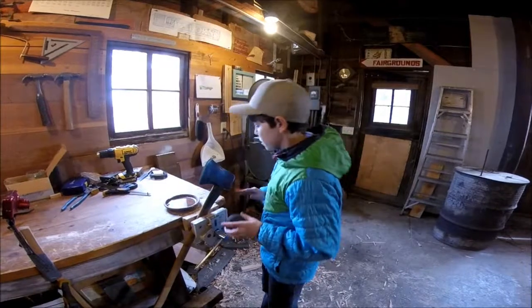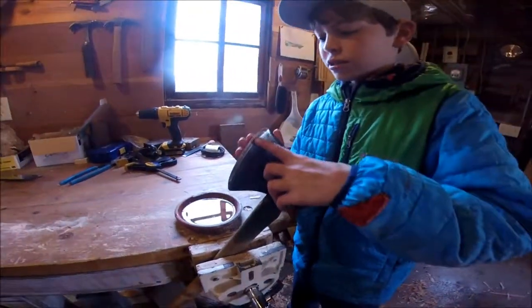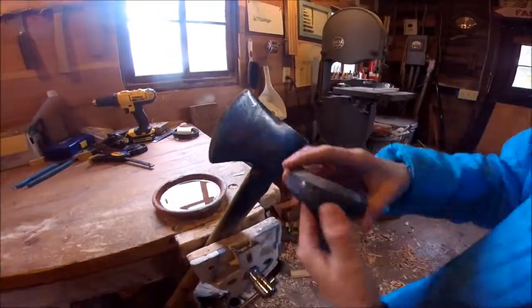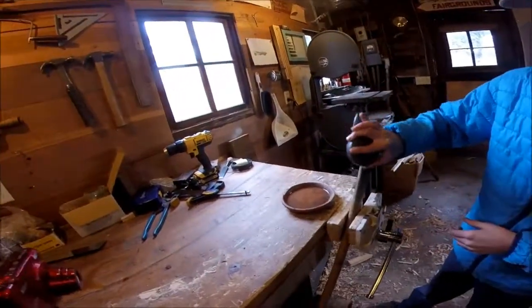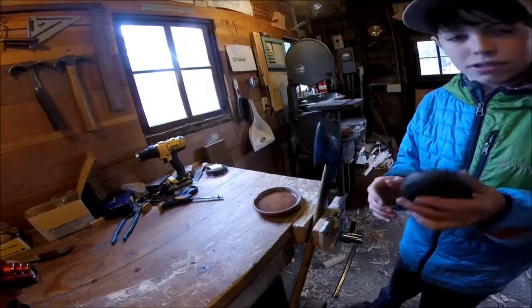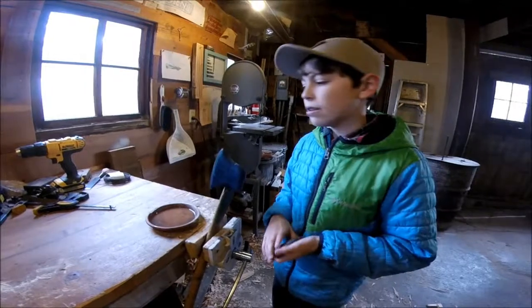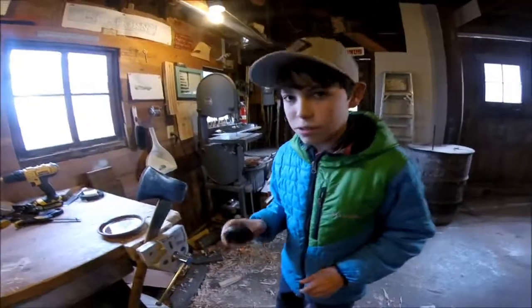When you're sharpening an axe, you have to follow the contour of the axe itself. So the angle that this is right now, I'm just going to keep following that. I just have to make it a little steeper so I'm grinding the edge, not the flat. In a circular motion, just like that. I'm just using a normal whetstone — you can pick these up at hardware stores for about five bucks. Keep them wet; they're actually a wet and dry stone, but they work better when they're wet.